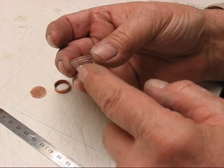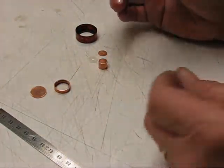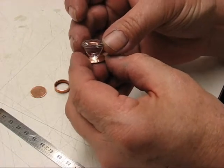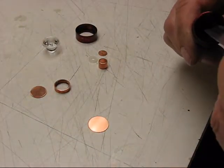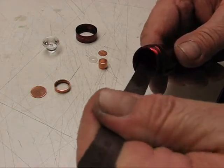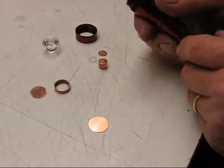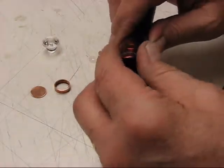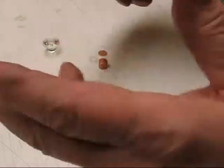The height of the optic is the reason I'm using it. It works for what I'm doing with these two AA mag lights. With the optic and a 1mm thick star and that copper round sitting down right at the top of the threads where the step is in the head — there's a step inside of there where the top of the threads are — that gives me a stack height where when I turn the bezel in, it actually tightens down on that optic and tightens the whole stack together and holds it all in place.